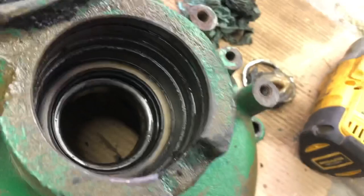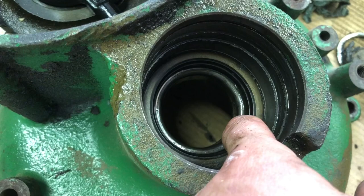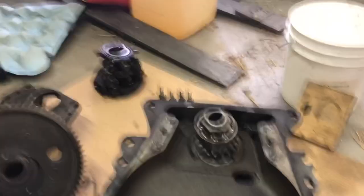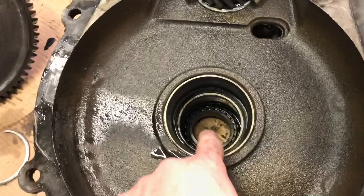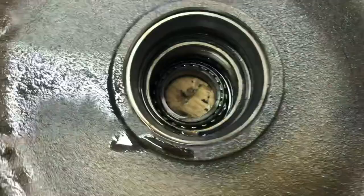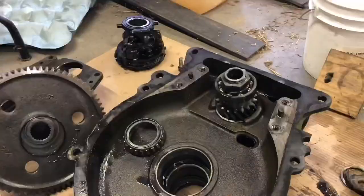So now we're going to see if we can get this seal out. I think I'm going to flip it over and see if I can get inside here with something and drive it this way. All right, I flipped it over. I just took this little bit of a bend and got it in that lip, and I drove it out. As soon as it gets off its sealing surface there's a step there — it drops right out and lets that come out as well. So now we'll flip that back up and check that seal out. Just as I suspected, there's nothing wrong with the seal. There is now because I messed it up taking it out.